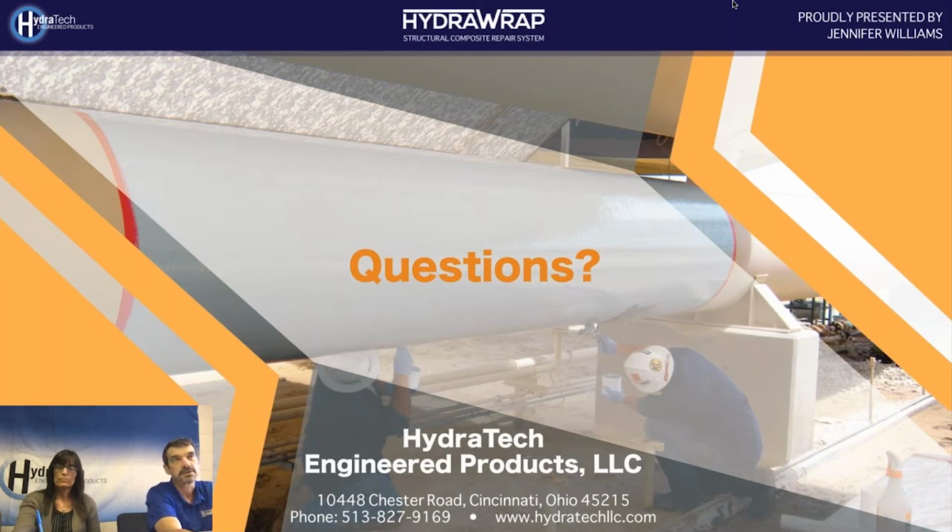Yeah, so the kits that we spoke about, the epoxy is pre-measured, so it does avoid any use of scale. It's what we call a 1-to-1 from a container. So you have the appropriate hardener and resin measured out. On the technical data sheets, there is a ratio for applying the wet out to the fabric. That can be verified in the field with a scale. Calculating, you should know based on how much fabric you're using, how many grams of weight that would be involved in the saturation of the fabric. For larger jobs, we obviously provide that as well, as far as what the ratio should be.